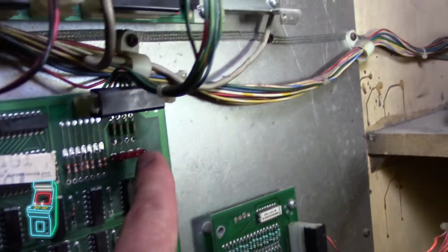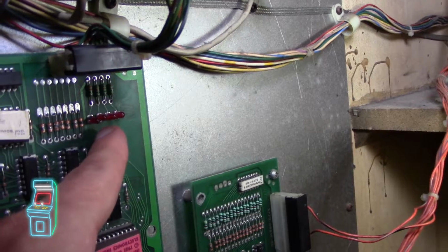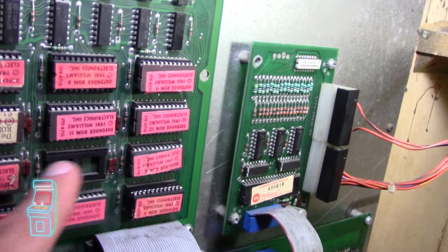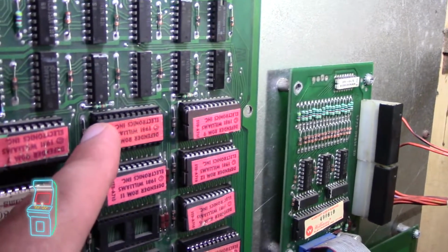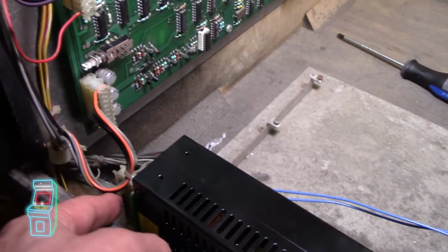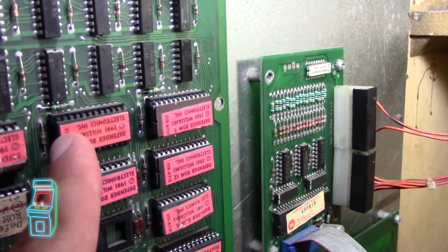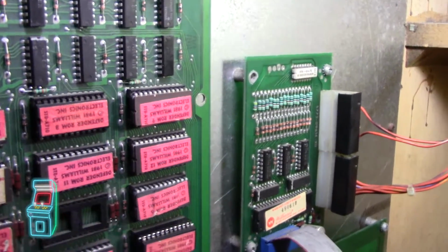So what's happening now is these 4 LEDs right here are supposed to, I think, flash twice and then continue, but they just stay lit the whole time. So I'm assuming it's because the ROM is bad. I did test voltage too. Not really sure. This switcher here is a switchable power supply with the upgrade adapter here. I am able to adjust the 5 volts. Sometimes this will be like 5.14, other times it'll be 4.98. I tried dialing it in, so I'm not sure if there's something else going on.